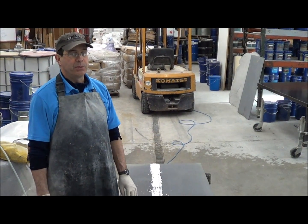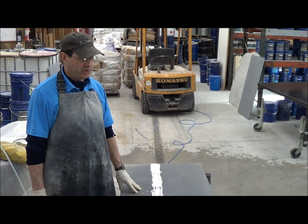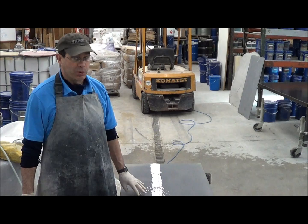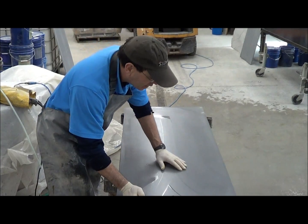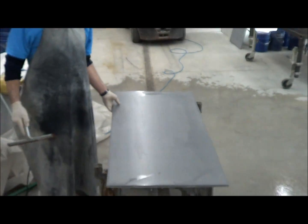It's the next day after we cast. We covered these with plastic at night with some insulating material on them. They're probably about 6,000 to 7,000 PSI based on our mix design and test results. What we're doing is hitting them very lightly with 400 grit just to take the cream layer off and show a little bit of the sand. Our sand is pure quartz sand so it stays white. As you can see, we've managed to create an absolutely beautiful tile — it's unblemished, with absolutely no bug holes whatsoever, not even the thought of a bug hole. These can be processed, and later we are going to show you how to seal these in our next video. Now we've got a large format floor tile almost ready to install. We'll see you next time.